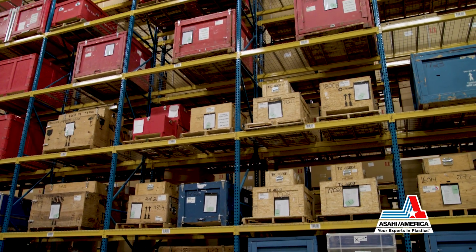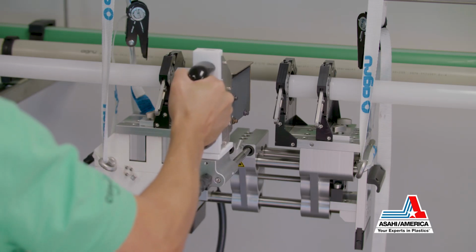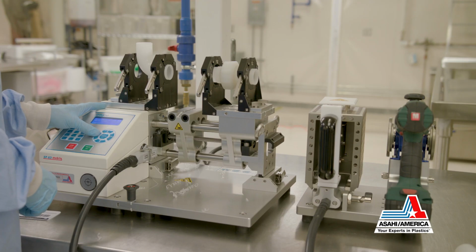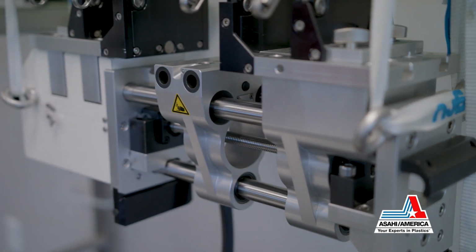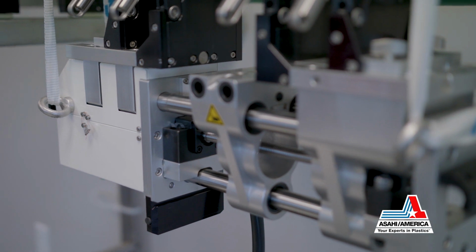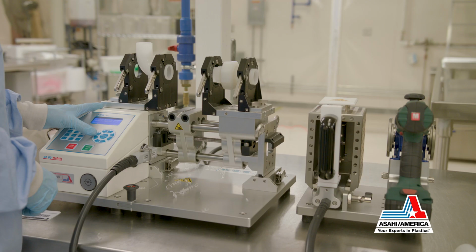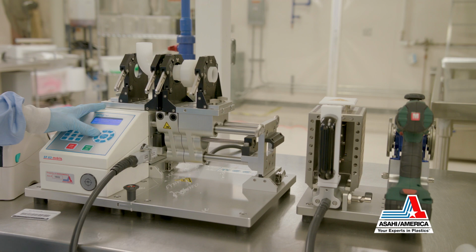All SP tools are available for purchase or rent. Featuring force control IR welding technology, SP series tools are known for making easily repeatable, reliable IR welds. The weld joining force is controlled by the pipe clamp's drivetrain, which pushes the pipe material together. The motor accurately controls the joining force, preventing cold welds and creating repeatable welds every time.